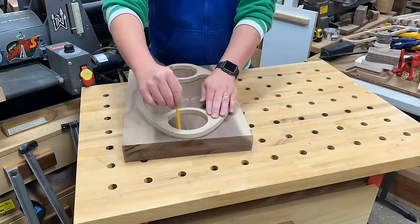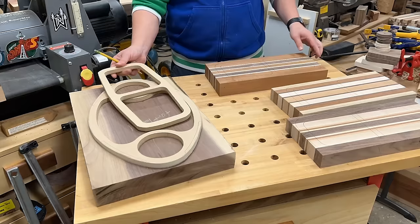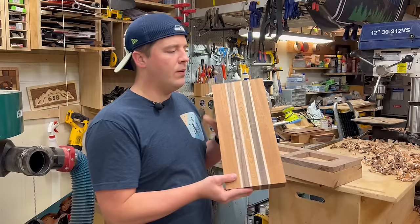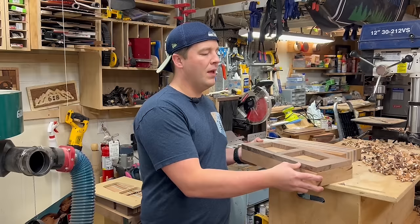I've got the template and my wood blanks — time to go. Tracing it to size, getting everything right where I want it, marking it out, and now I need to hog out the material in the middle. Once you have all your blanks created — whether a solid species, a two-layer piece, or an edge grain piece — trace out your outline for the template. On this one, you can see the pencil marks so I have a feel for where it's going to be.